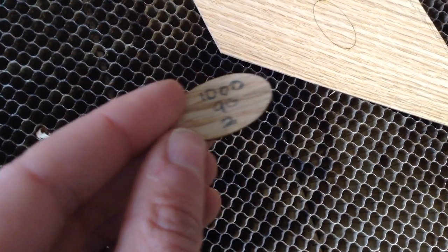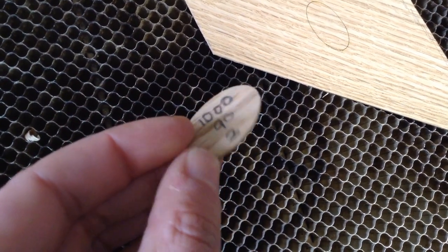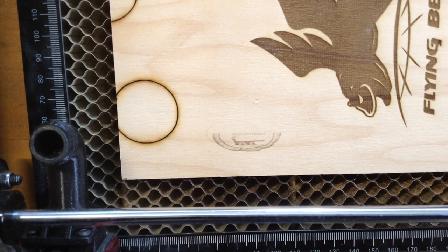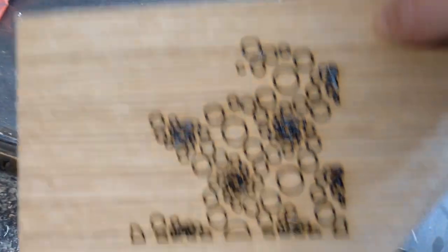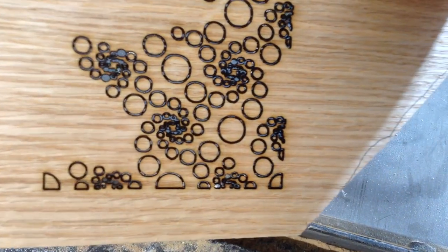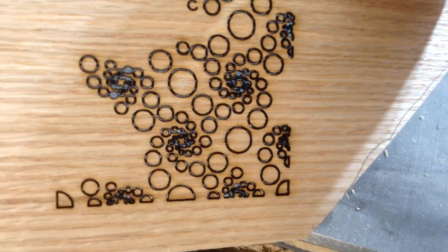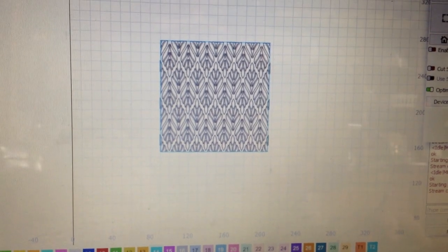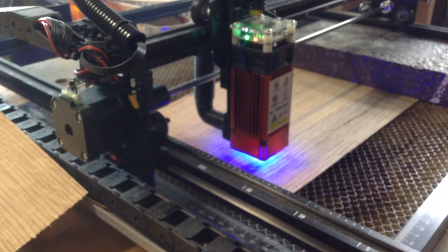And this is kind of an example of that. Unfortunately, and I was kind of embarrassed about this, this was happening because I never switched back from the rotary setting in the display. I had to turn off rotary in the display on the machine, and then once I did that, everything was fixed. It took an embarrassing amount of troubleshooting to figure out that I had forgotten to do that.